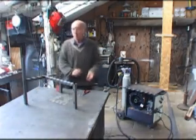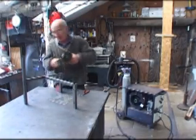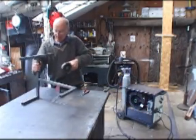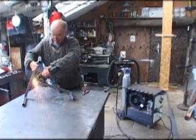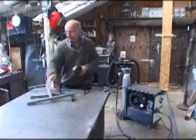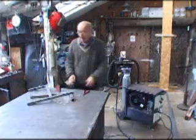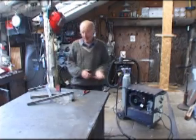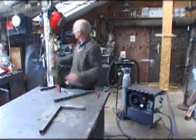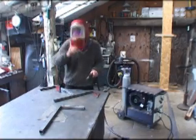But if I've got it in the wrong place, I can equally quickly grind it off and start all over again. If it turns out to be the right place, later on I can go along the lines of welds and make them continuous into something really strong.